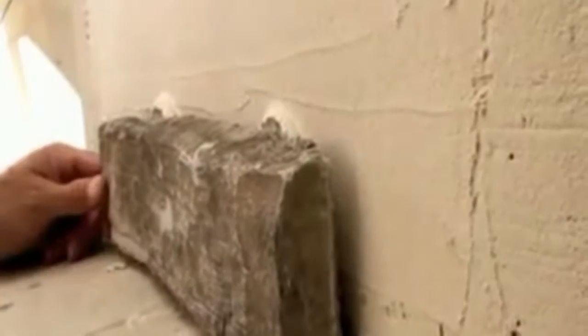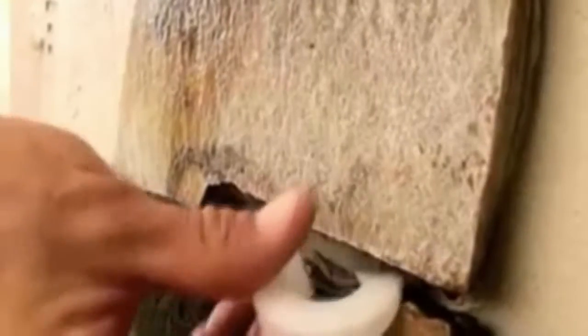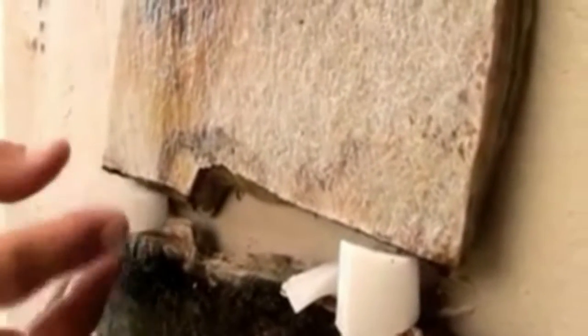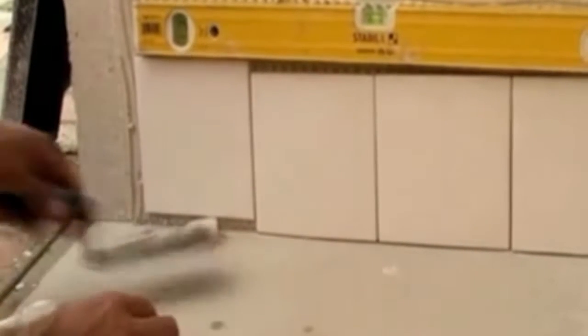Listen up, Masons. As you know, there has never been a spacer specifically designed for masonry. Until now, rocks, sticks, and cardboard have been the method of choice for spacing masonry stone. Finally, the large roto wedge offers the masonry industry a professional spacing solution that ranges from an impressive 1/16th to 7/8 of an inch. The roto wedge works amazing at getting the bottom row of stone or tile level and secure to support the rest of the material.